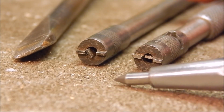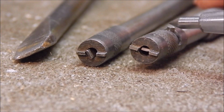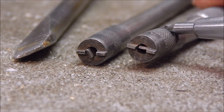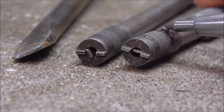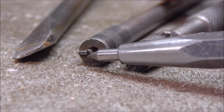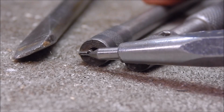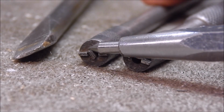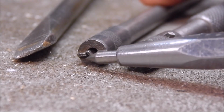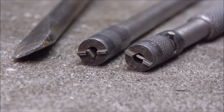The way it works is you put your screw head up against it, so this goes into the screw slot. You then press against the screw. That releases a lock cam dog on the back here, which shoots the middle section forward and also twists it at the same time, so that it actually jams in the slot, using the two sides here to locate it, but the centre section twists and jams in the slot and grips it. It works very well, and it will work on any size screw.